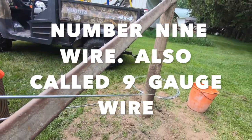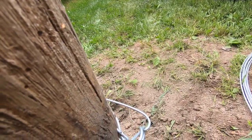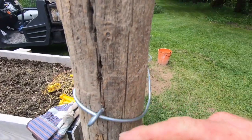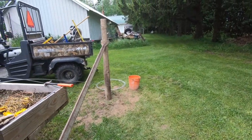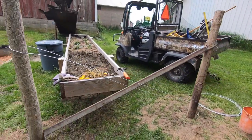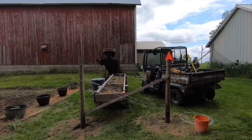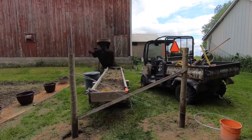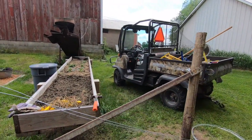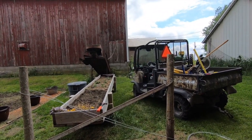I use some really heavy gauge wire. I put a staple in the bottom end, put a little kink in the wire, come around and put a staple in the top. When you put the braces on, you don't want to go too steep with the brace. If you go too steep, you will jack your post right out of the ground — you defeat the purpose of it. It's to keep the post from tipping in. You might think that by going at a steeper angle you'll have more leverage — that's true — and that leverage will jack your post right out of the ground.